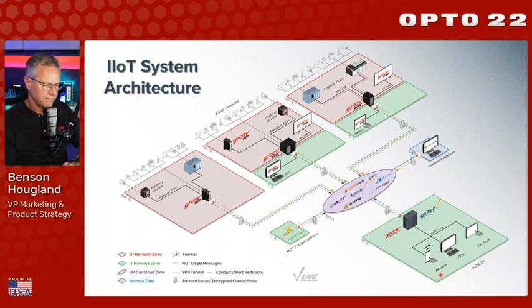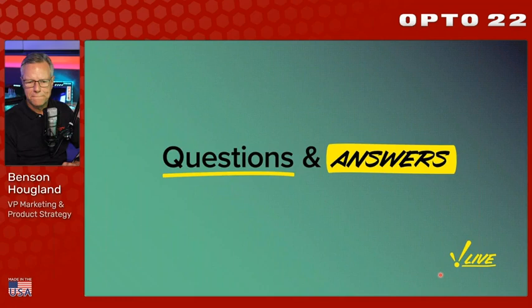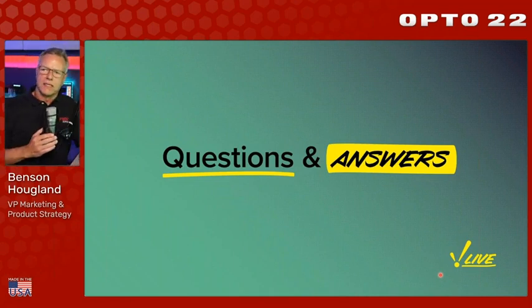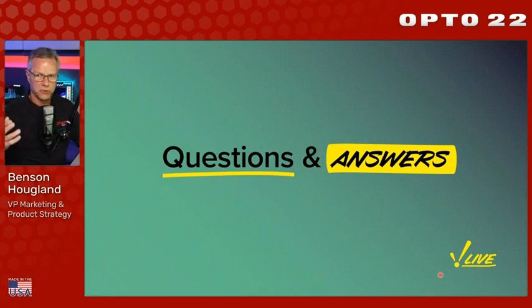A question: when Inductive releases a new version of Ignition, do you have to update the firmware in the Rio? Yes. When a new release of Ignition Edge or full Ignition comes out, Opto 22 gets the new installer, puts it into their build process, runs it through QA to make sure all pieces work together, and then releases it. There may be a lag between when it's available from Inductive Automation and when it appears in the Opto 22 firmware. Upgrades to Ignition are done through Epic or Rio firmware upgrades.